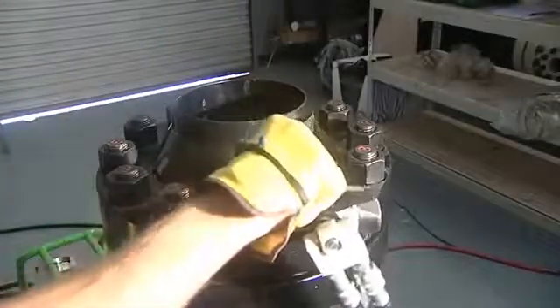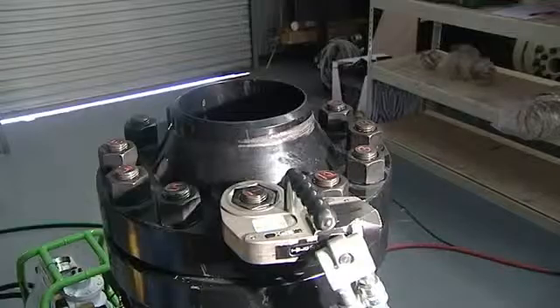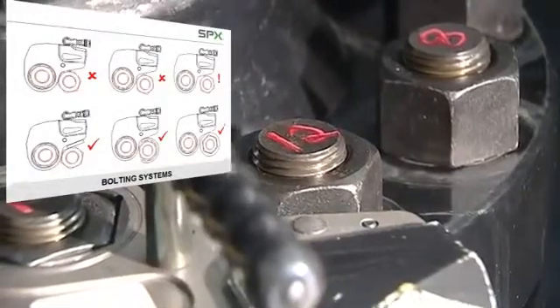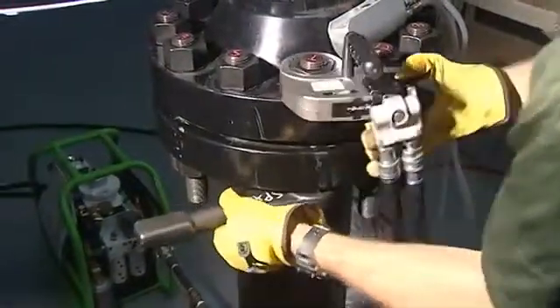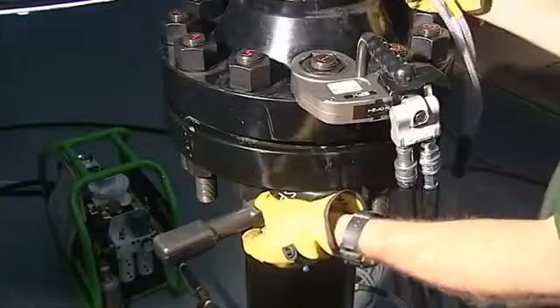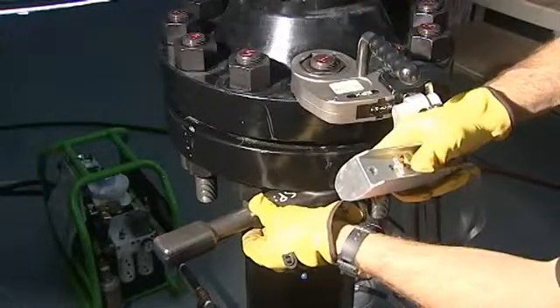You are now ready to bolt your flange. Install the safety handle if applicable. Put the wrench on the first nut to be torqued. When using a low clearance tool, make sure it is positioned correctly on the flange and reacting against the flat of the adjacent nut if possible. Be aware of pinch points. If using a backup wrench, make sure your fingers are clear and you are standing to the side, as this wrench will swing and move when pressure is applied. High pressure hydraulics can be dangerous if you are not taking all safety precautions and paying 100% attention to your job.